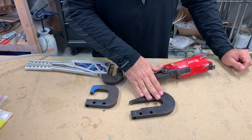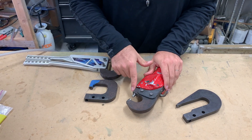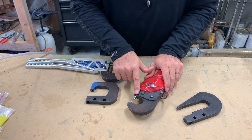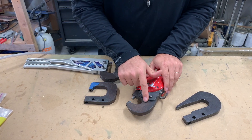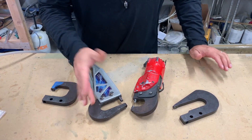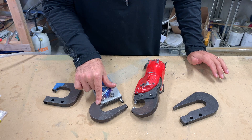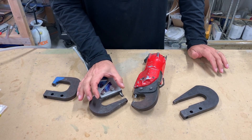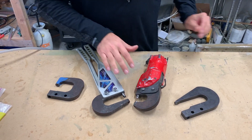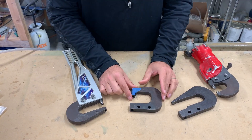Then there's the regular — I think this is a one-and-a-half inch yoke. There's a ton of metal here, so it's not going to flex, it's going to be straight and work great. I don't use this one very much because I find this two or three inch yoke doesn't flex for the rivet sizes we use and it's a little bigger, so you can use it in more places. I would probably not buy the smaller one again and would just buy this one.